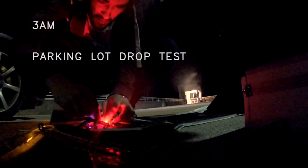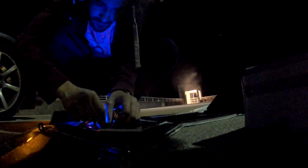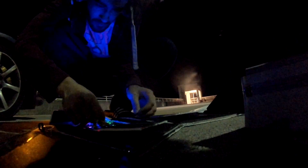This is the night before another test flight day. Long story short, ArduPlane gets confused when it's at negative 90 degrees for too long. To circumvent this, I had the aircraft at a negative 20-degree angle of attack on the tether, so when it got cut it would be able to generate airspeed fast enough without stalling out.